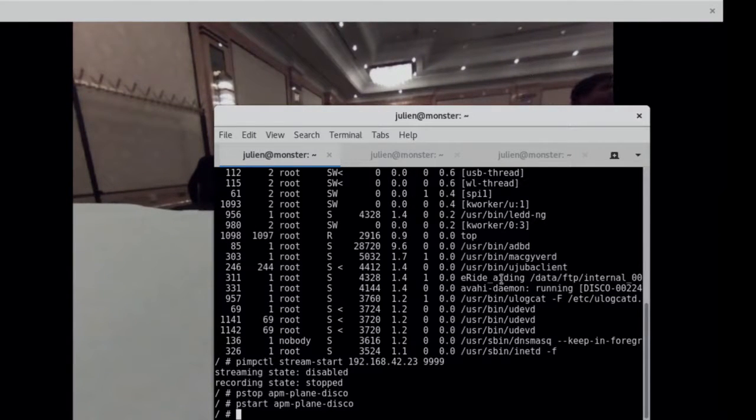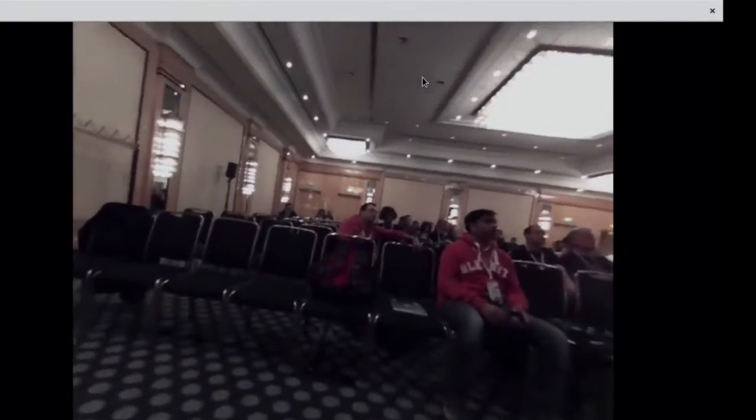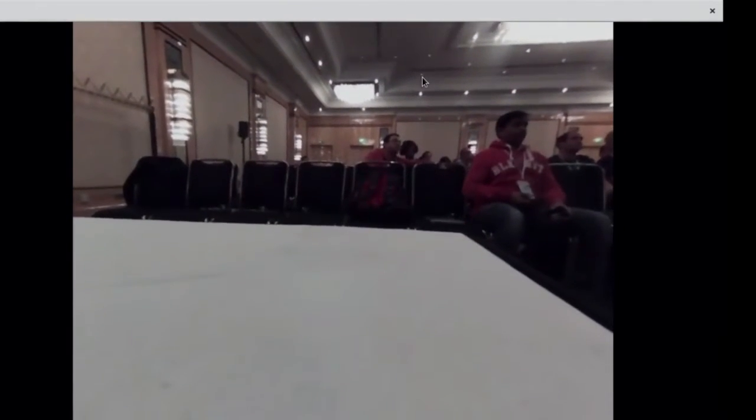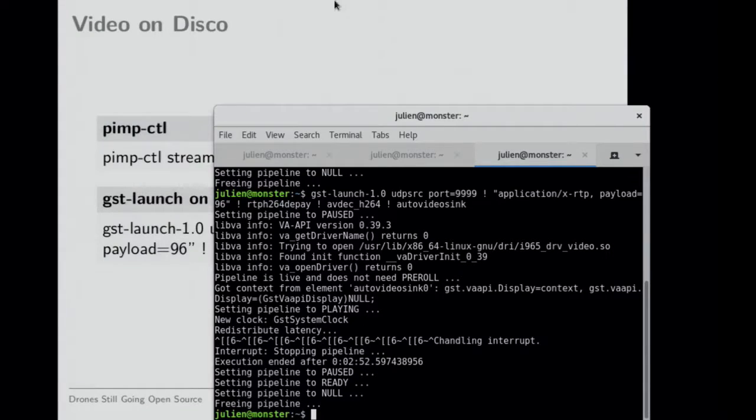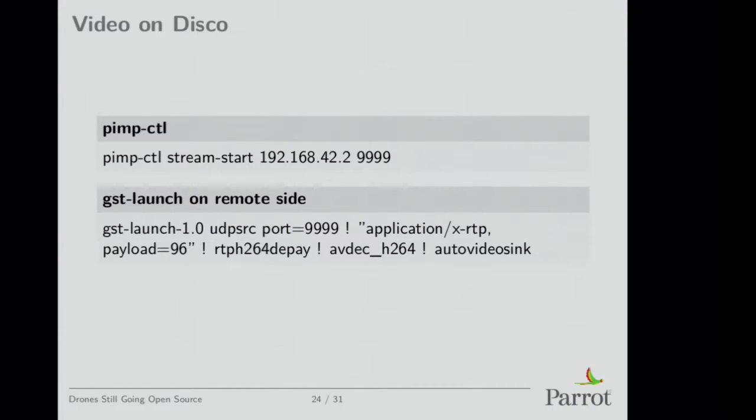You can stabilize on any axis you want. The thing is — what do you stabilize on? Where are you looking? If you want to fix on a given target, you can stabilize on high frequencies in that direction, but at low frequencies you have to get back to where you are. You can just play the video with GStreamer — it's a GStreamer application embedded on the drone. The servos make the small noise you hear; the autopilot stabilizes even when not flying, so the servos try to compensate for the position of the drone.